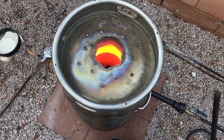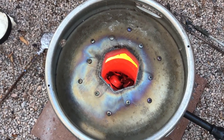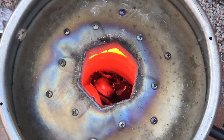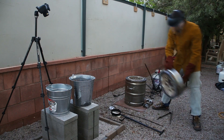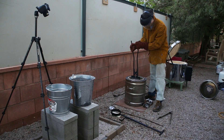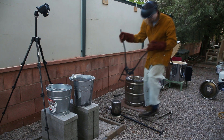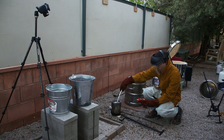As the shells were heating up in the kiln, I started melting some aluminum in my homemade furnace. When the aluminum was melted, I removed the crucible from the furnace and then checked to make sure that the metal was at the right temperature. I was aiming for about 1400 degrees Fahrenheit, which is about 750 degrees Celsius.